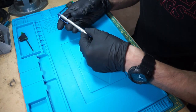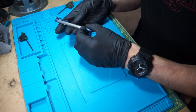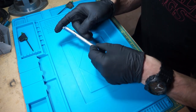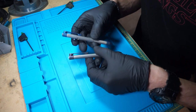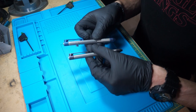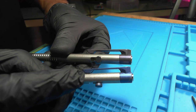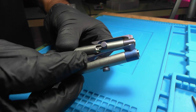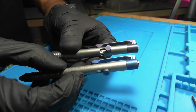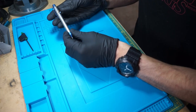All the polarities have obviously been checked because I want every pen to have the same polarity. When I build my stand, I can actually have the magnets and everything will work out — you'd just have to flip the magnet around, but I like to keep things consistent. On this pen compared to my old one, this pocket clip is only about a tenth away from the body, and this one's a little bit further. I just increased it a bit more to make sliding into a pair of jeans easier. I also tweaked some of the geometry slightly on the ramps, and the location of the pin in comparison to the bolt changed slightly as well — just to make it sit more comfortably in your pocket. Forever little improvements.